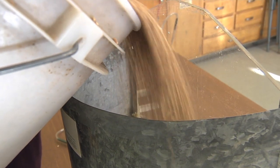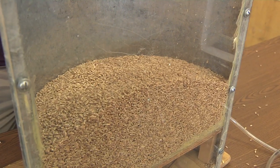Now we're going to add some grain to the bin. For today's demonstration, we're using hard red spring wheat. Each type of grain has its own characteristic for static pressure. Wheat, with its smaller kernel, packs fairly dense and is difficult to move air through, so it has a higher static pressure than corn or soybeans, where larger kernels make airflow easier. One misconception is that switching from a wheat bin to corn automatically doubles airflow — that isn't necessarily true because each fan has its own operating characteristic, especially high-speed centrifugal fans designed for high pressures.